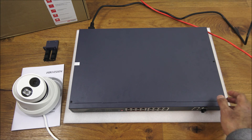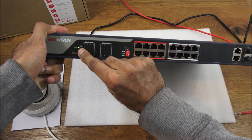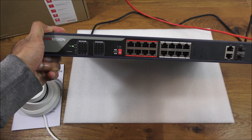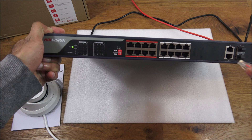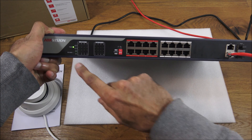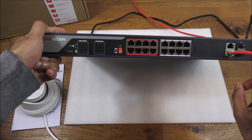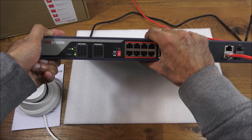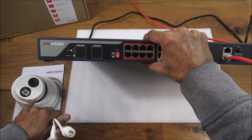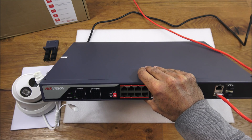If I lift this up slightly you can see the power lights have come on. The uplink port is here — plugging into G1, and there you go, G1 has come on because I've connected it to the router. This is the camera powered by Power over Ethernet.